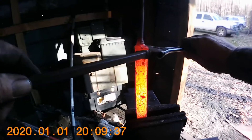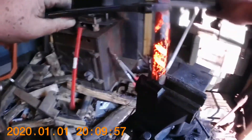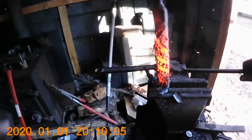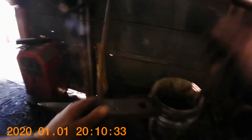Snug it up, put the wrench on and twist. You can see the scale popping off as the steel moves. I probably should have switched to the helmet mount for the camera but I just couldn't be bothered — better luck next time. You can really see how the billet's twisting, and you can see how the corners — if that had been left square — the corners would make a spiral pattern, and then when you work it back out to square, they'd fold back in and make cold shuts. Brush everything off. I could add a little flux at this point just to keep everything clean, but I don't think it's needed.